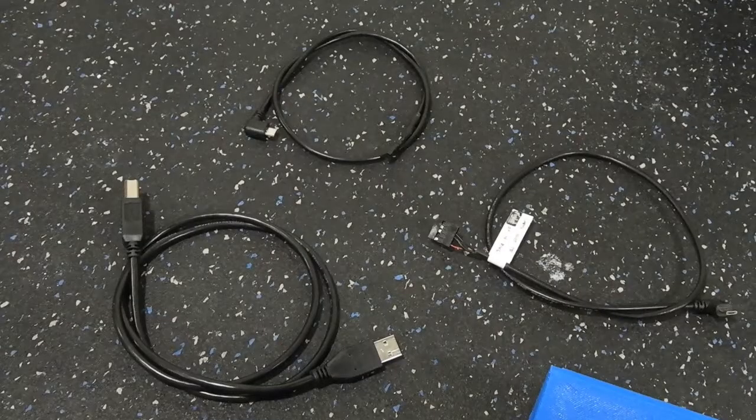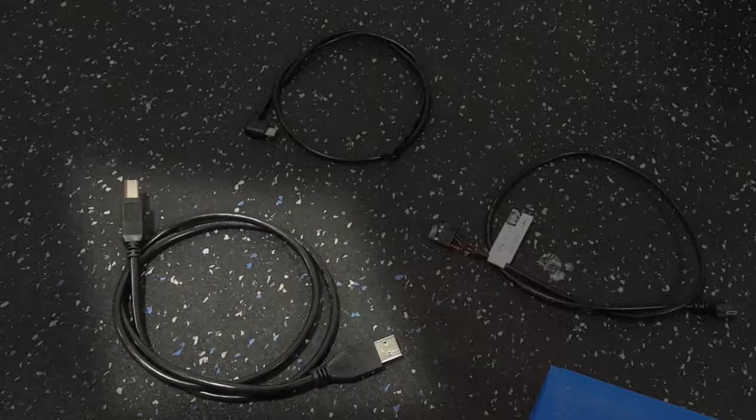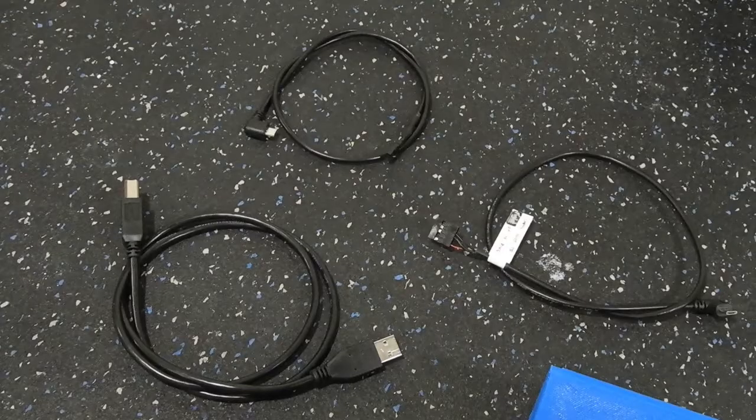For either mainboard installation, you need 2 cables to connect the touchscreen. All versions will require a USB A to B printer cable to connect from the Raspberry Pi USB to the mainboard USB in the back of the printer. The other required cable is the power cable specific to your mainboard.